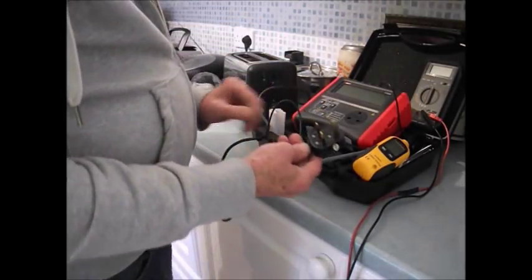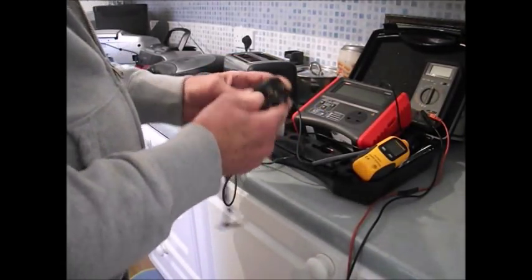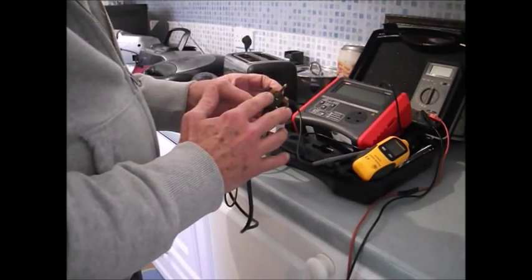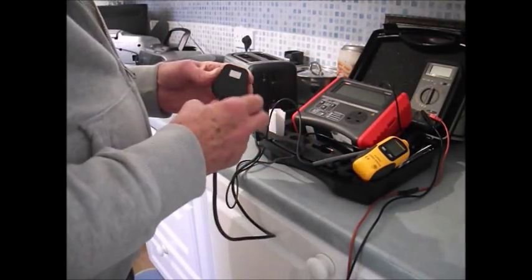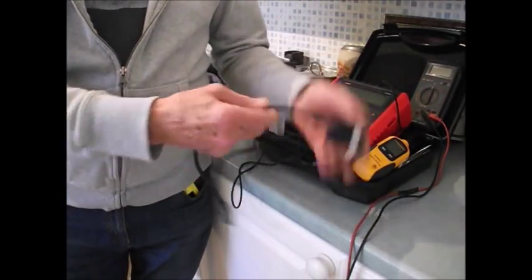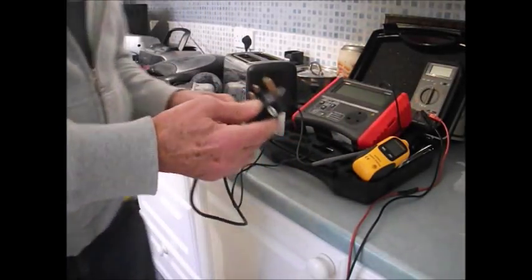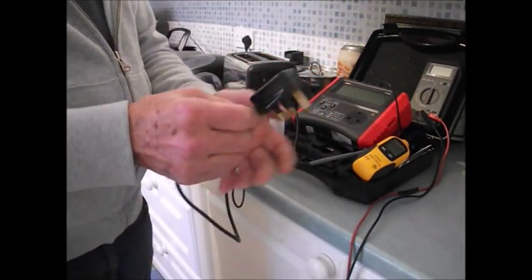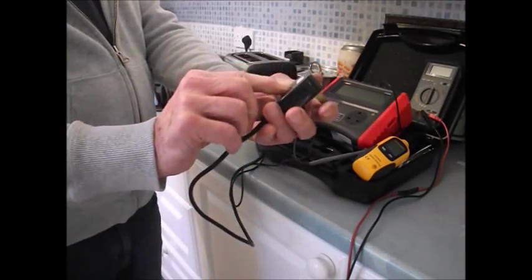First of all, you look at the plug, and you say 'yes, that's a plug.' Check the plug. Make sure it's not cracked. Make sure it's got the insulation on the positive and negative. If it hasn't got the insulation, the plug's no good — top it off and throw it away. I like to chop plugs off, because you find many faults on things which don't work anymore, and what it's down to is the lead — it's been plugged and unplugged so much it breaks. You might as well chop that off and refit it. You're checking the plug for any cracks as well. Look for a kite marking — on this one it's on the back, just there. See?